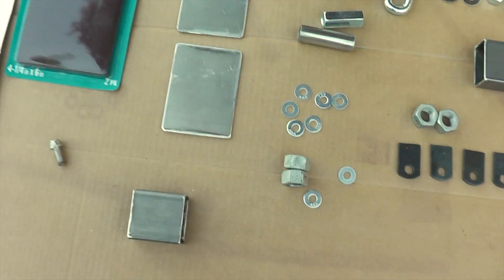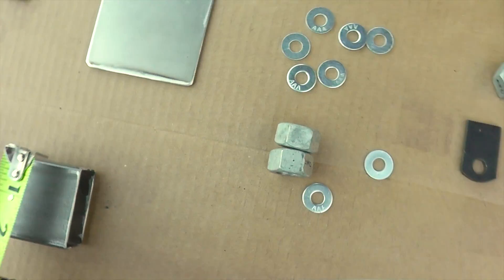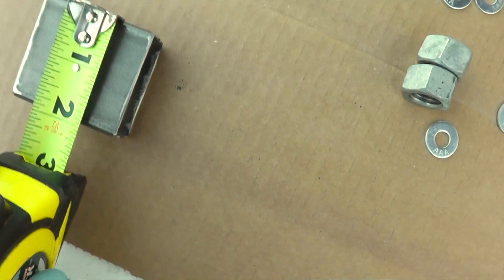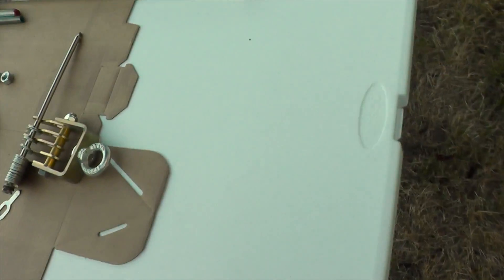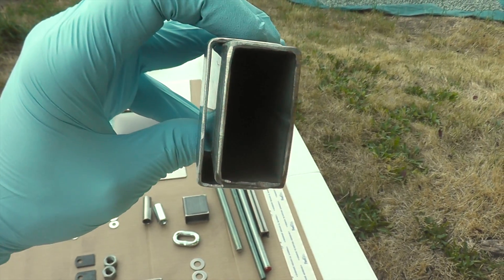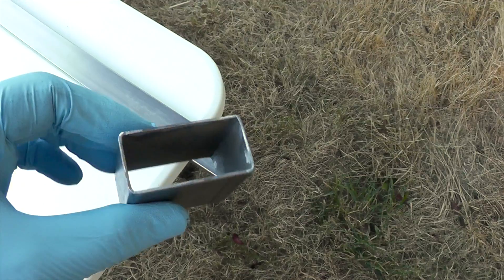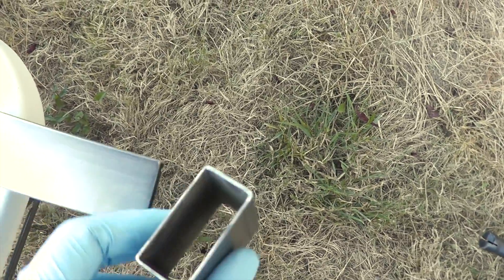The first thing we'll need to do is the measurements. This is my own design — two inches wide and almost two inches tall. We're going to cut these down because this is our main beam. When I slide it over, you can see the side-to-side play and that gap on the side, which is okay. However, the bottom gap is not okay, so we're going to have to modify this piece. I drew my line a little bit above the beam and now I'm going to make the cut here, same thing on the other side.